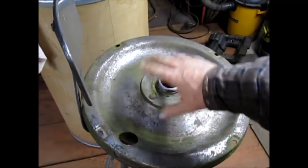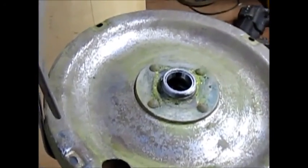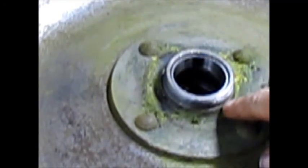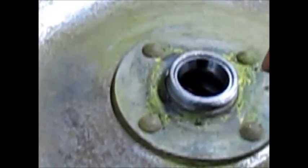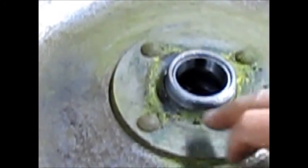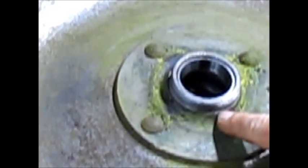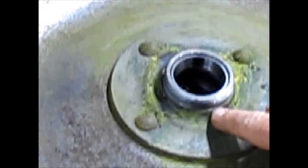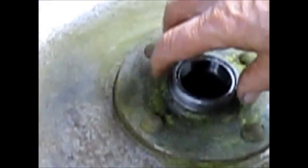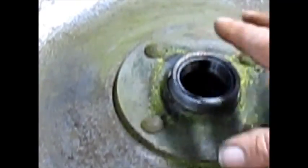All right, so this is the back side of the hub, and there's the wheel bearings. So the problem was, if you'll look, you'll see that there's really nothing to grab onto or bottom up against. Now, I wanted to bottom up against this, but there's these four rivets in the way, and plus this is a bit rounded, so it's not accurate. But this one little edge right there, I could bottom up against, but I couldn't because I had the aluminum chips to protect the threads. And so it just kept pushing past the aluminum, it would never get squared up.